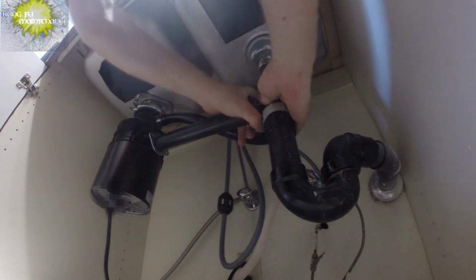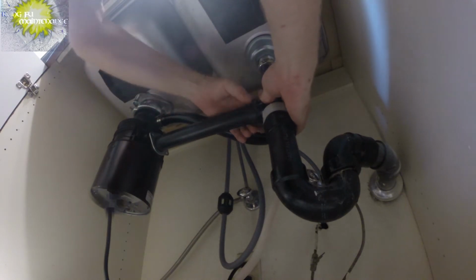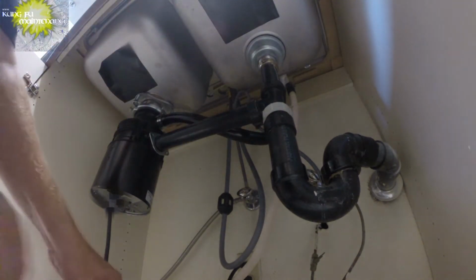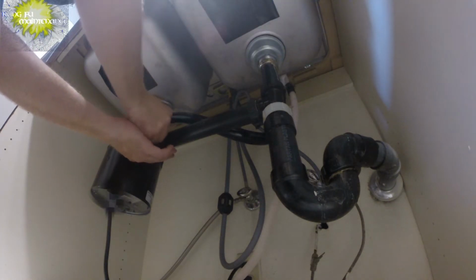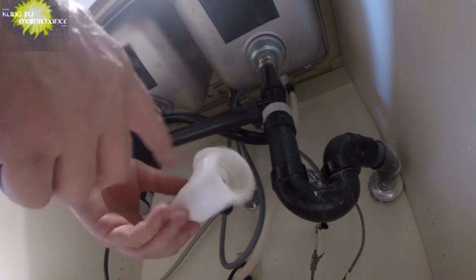It's just all hand tightened. If you needed to trim it, you'd want to trim the non-beveled end, on this portion. That one was a little stubborn. Definitely going to need to leak check that, and we'll do a pressure test. Make sure nothing's leaking. I didn't want to just leave this open under there. Just a place for stuff to get clogged up, especially as this gets smaller in the T. This is actually a T piece, and that stuff was already getting clogged up in there.